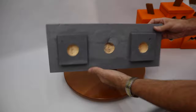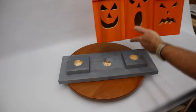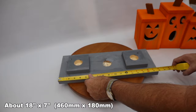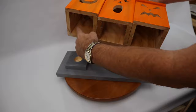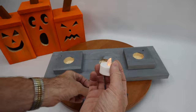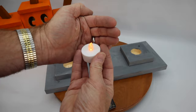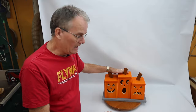I didn't really talk about the size because I was making it up as I went — I just sized the base about an inch longer and an inch deeper than the unit. For completeness, it's just under 18 inches long and seven inches front to back. The blocks are cut to roughly fit within the openings to give it a registration spot so it doesn't move around. The lights are just little LED tea lights my wife picked up at the dollar store — they have a little flickering effect that makes them look like candles inside. So that's all you need: a couple of fence boards, a saw, a drill, and a little bit of craft store paint. That's about it for this one — we'll see you on the next one.